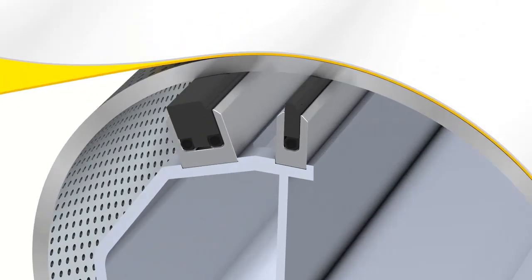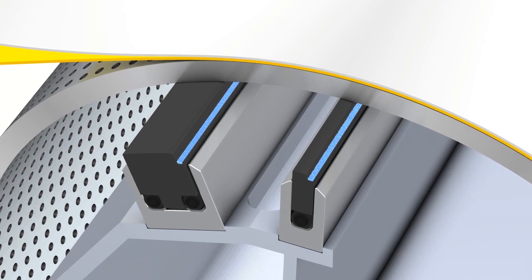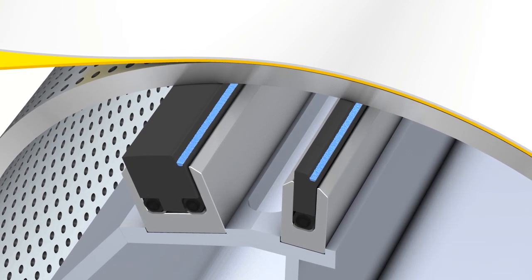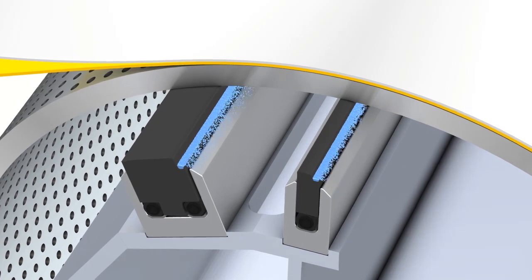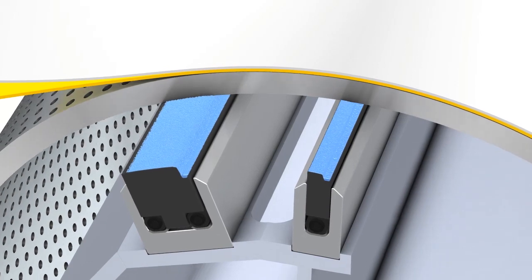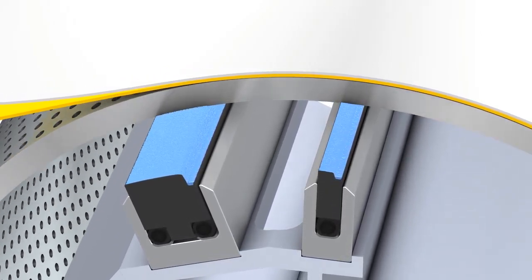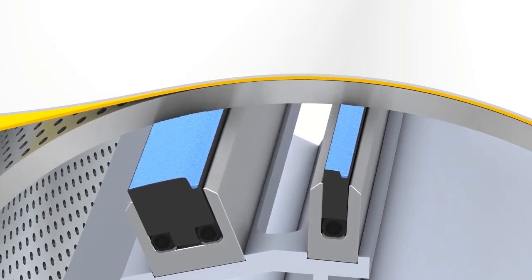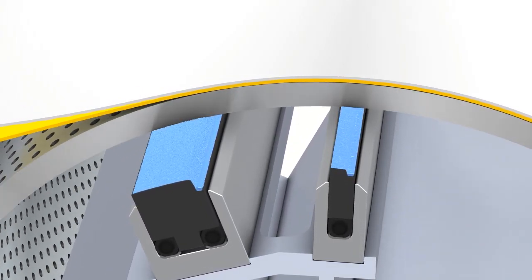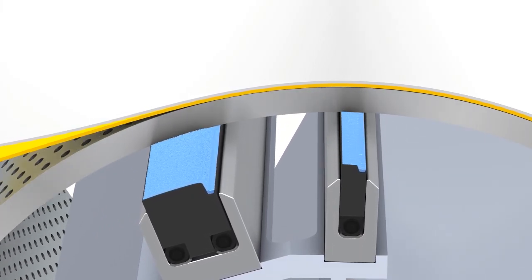With the innovative design, each sealing strip has its own water supply. Controlled water pressure and the rotation of the roll shell ensure that cooling water is applied as needed. A system of channels applies a thin, homogeneous layer of lubrication over the entire surface of the sealing strip. As a result, there's hardly any water that could be misdirected and negatively influence the moisture profile of the felt or the paper web.